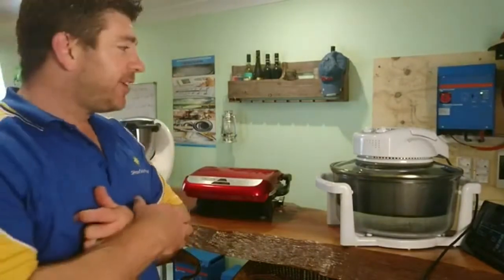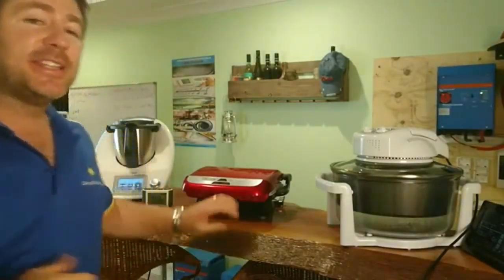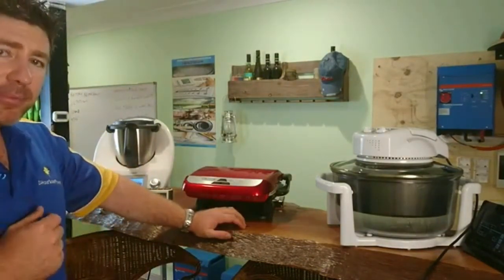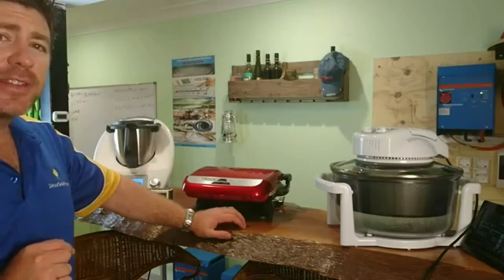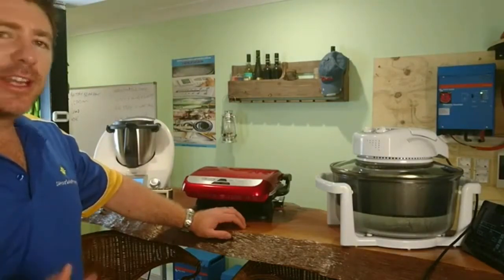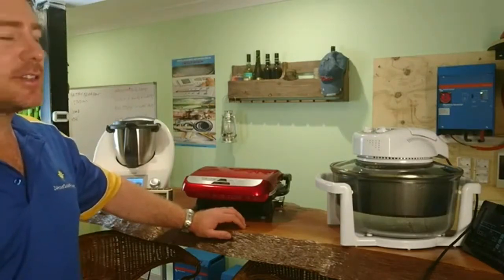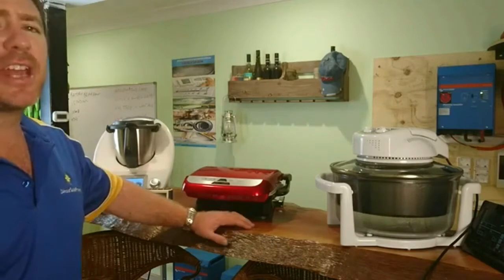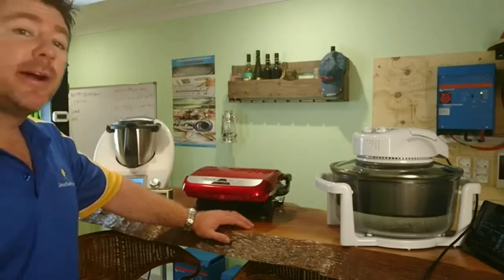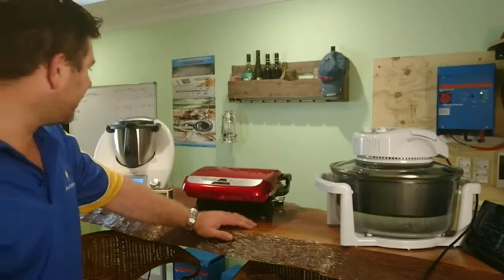If these monitoring devices cost too much money, it's actually easy to go to the front, read your meter, take down the numbers, go inside and turn the device on, then when you're done go back outside and read the meter to see how much energy that device consumed. It won't be perfectly accurate since everything in your house is running, so it might be worth doing it over an hour to see your base load — and it's doable without spending any money.